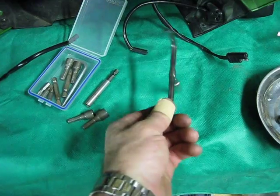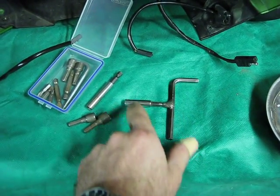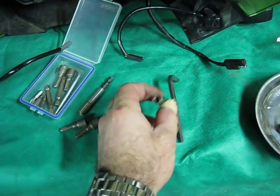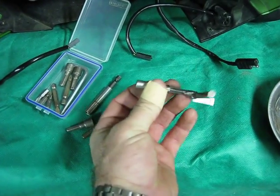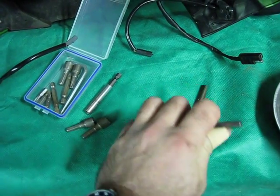What I did is I started with a — I believe that's a 6mm Allen key — and I welded on a fitting. That's just a magnetic driver fitting that normally goes in your drill, to make up a T-handle spanner.